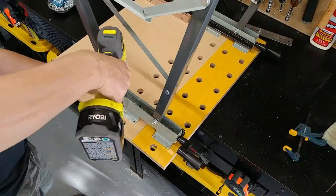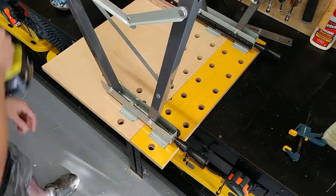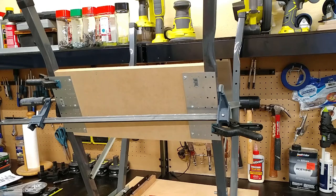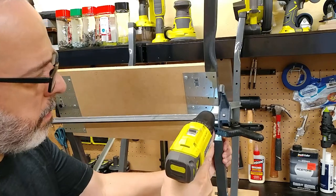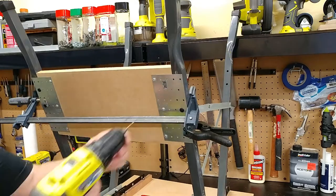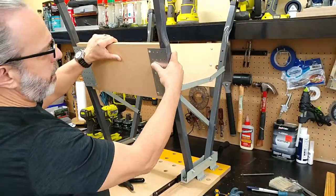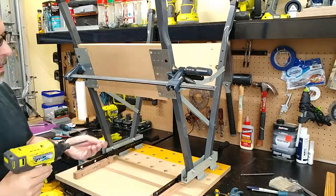With the tracks in place, we can put the deck back together and move on to the stringers. You need to make a notch to clear the rivet that holds the folding mechanism in place, pre-mount the plates with about a one-inch overhang, and that's it. I'm holding the plates to the MDF with one-inch 8-32 bolts, nuts, and washers, and holding the stringer in place with half-inch self-tappers which I pre-drill because I don't trust that tapping mechanism. On the other side, the rivet for the folding mechanism is much lower, so I ended up notching the bottom corner of the stringer on the router table.